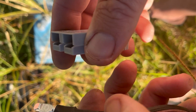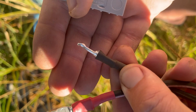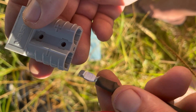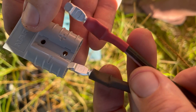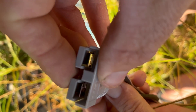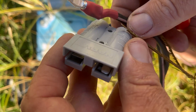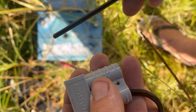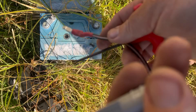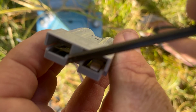If you've never hooked up one of these Anderson plugs before, you'll see there's a little lip on the plug — just there. That little lip goes over that piece in there. Just make sure you've got your negative side and your positive side. Your negative one goes up into there. Push him up into there. See, that's just pushed over that little edge there and clipped in. I'll just use a four mil Allen — see that there's hooked in over the edge in there.